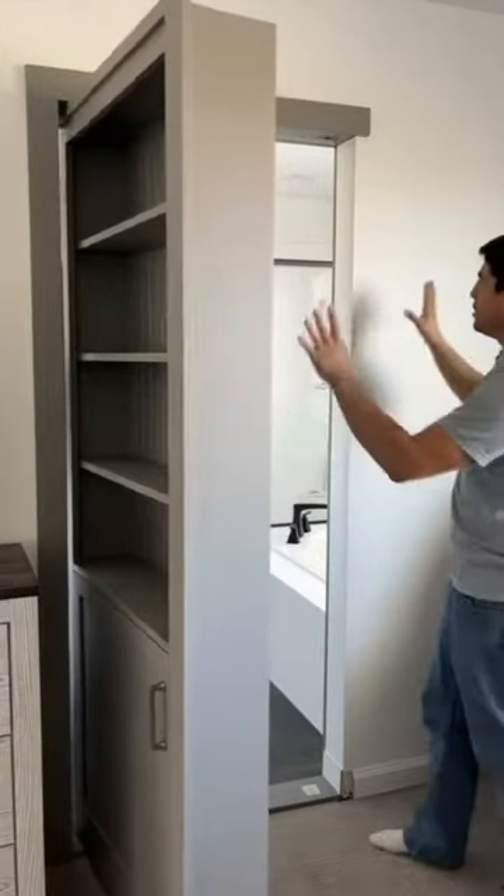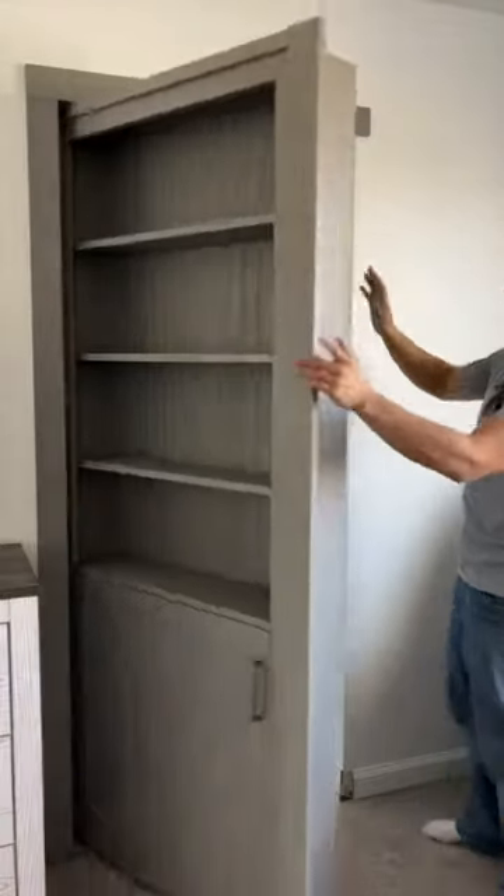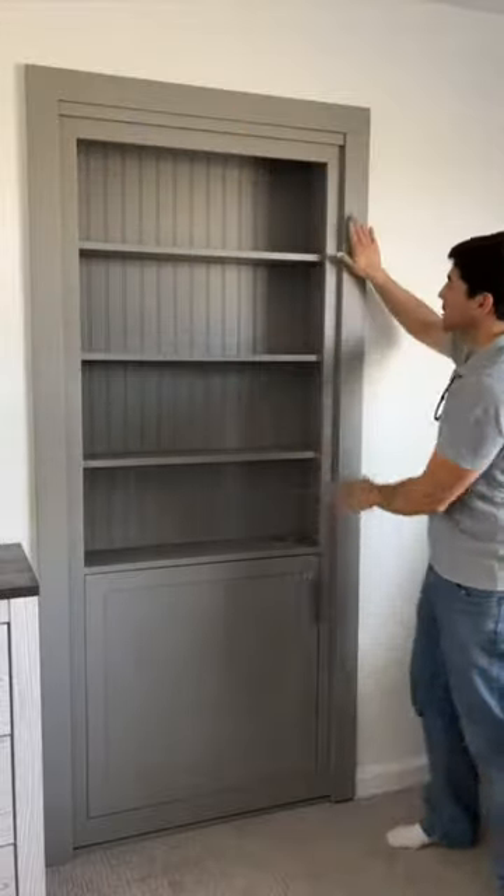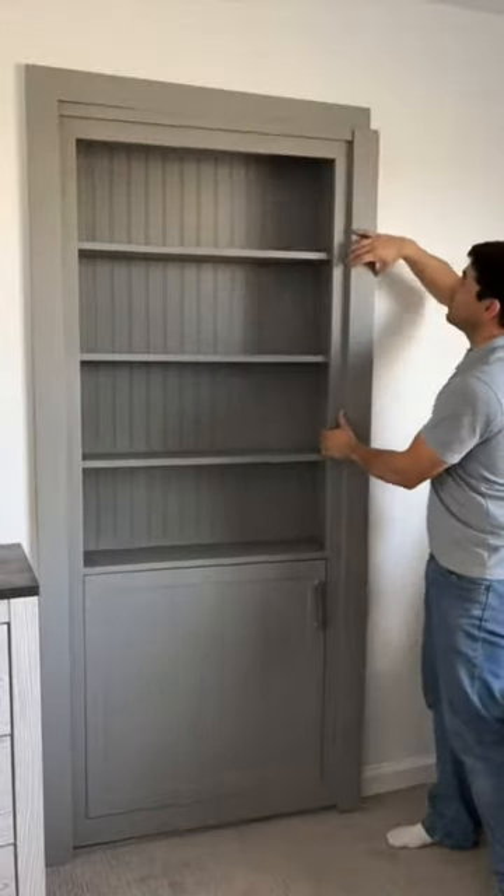Just want to make you aware that if you're having an out swing, finish the edge of which you're opening. If you're an in swing, it won't matter because the door casing will cover it. This door casing is attached to the whole molding — it's just one piece on an out swing; this one comes out.